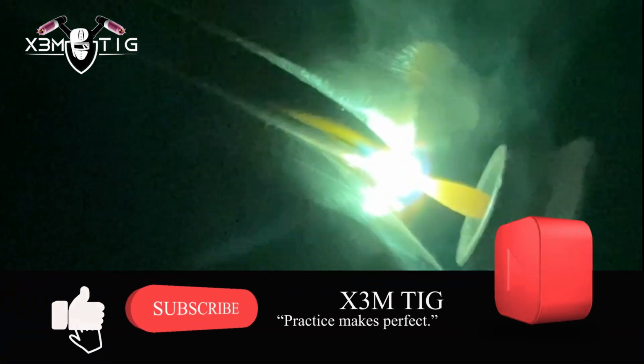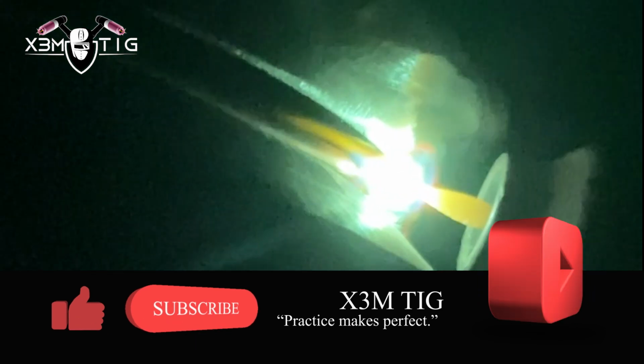You don't want to have a shallow root on the bottom, especially for the hot pass. If you got suck back, that might be really tricky, especially for the X-ray. I might see it as not enough penetration.